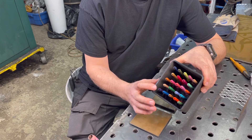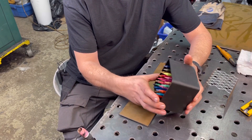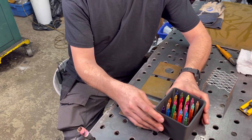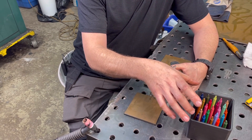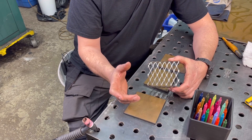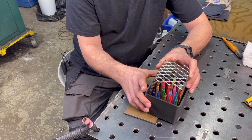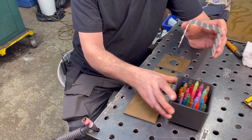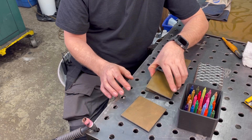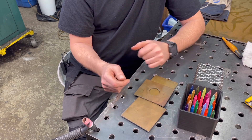The prints came out really nice, and I already have the crayons in there. It's about 4 inches by 3.5 inches — basically the size of one of the bricks — so it's going to fit inside the cavity I left. Before I get this ready for the refractory cement, I also want to get the steel part that my gas fitting and air inlet will be attached to. The mesh will cause turbulence to mix the air, and it's also going to help connect the steel part to the refractory cement. I have the two sides, the front and back, and the lid with the inlet tube for air. Let's get all these welded up so I can start pouring the refractory.